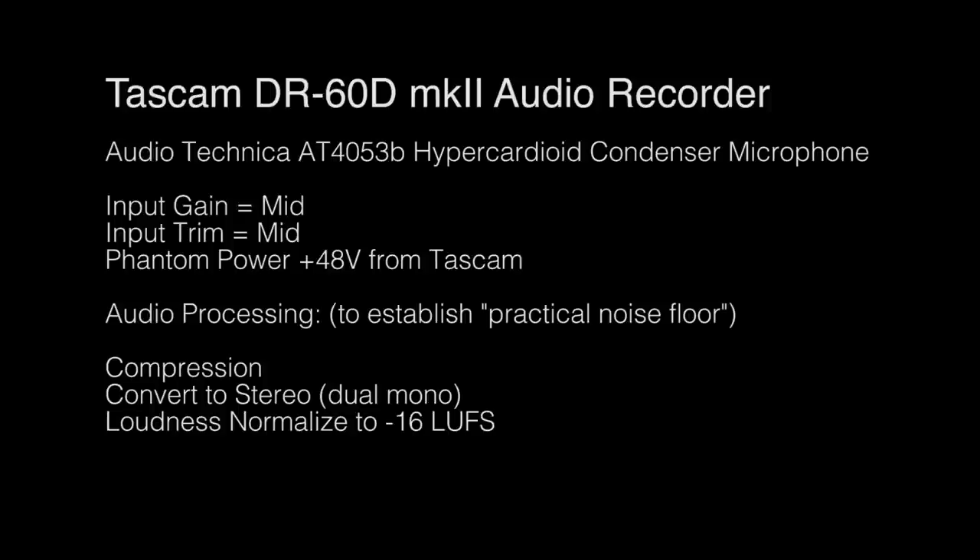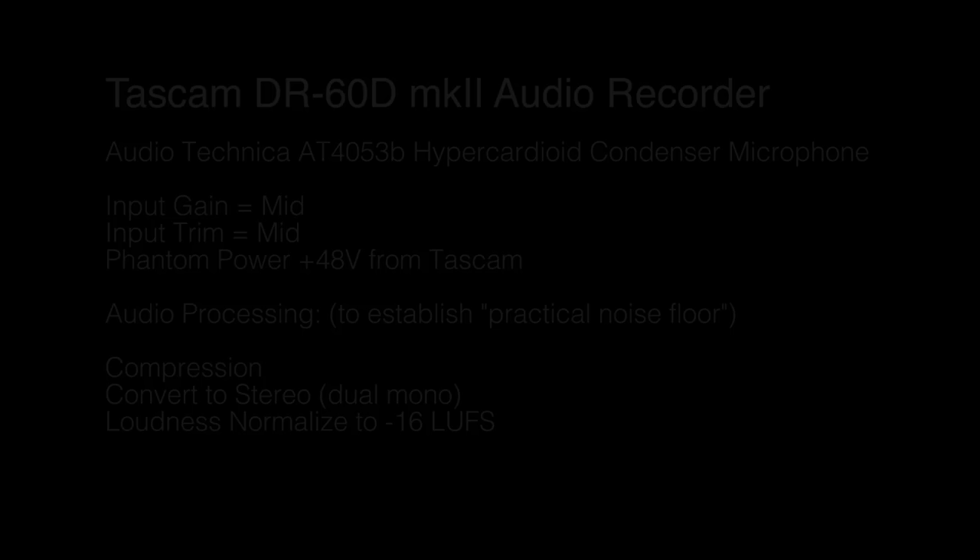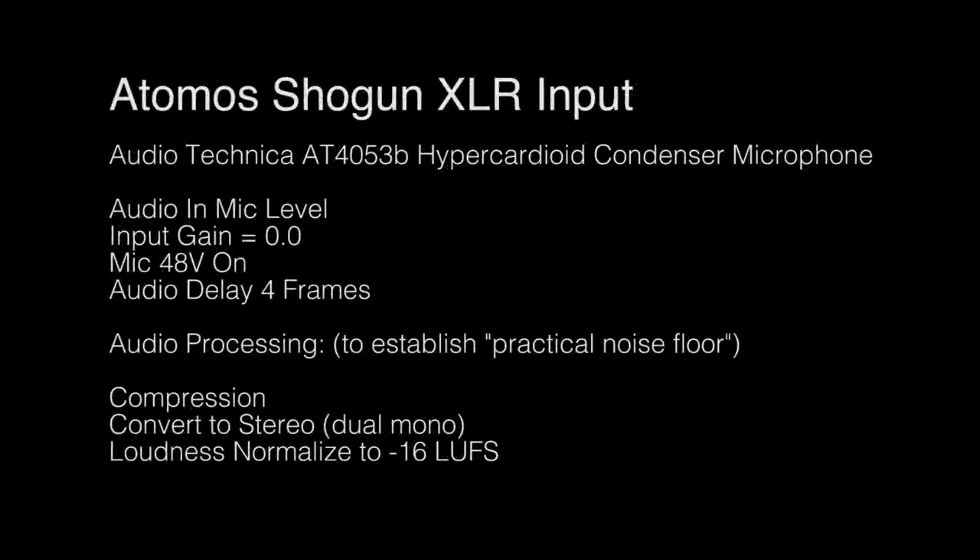The screen is beautiful, full of clear detail, and can be calibrated. If you purchase the Datacolor Spyder for the Shogun, you can calibrate it using your Mac or PC. Attach the colorimeter via USB to your computer and the Shogun via the remote port to the USB cable on your computer, then run the Atomos calibration app. In just a couple of minutes, it makes RGB color readings at various luma levels, reports the Delta-E, creates a LUT, and loads the LUT into the Shogun — giving you a Rec. 709 calibrated 7-inch touchscreen. My copy of the Shogun had overall decent Delta-Es with the highest still under 2.